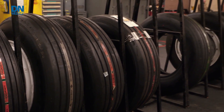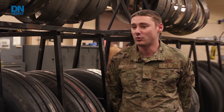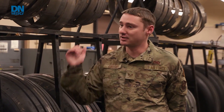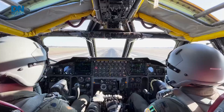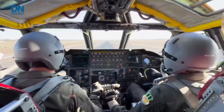Why is it important for the wheels to be in tip-top shape? It's important because if a wheel has damage on it, it can break on the flight line itself. If the jet comes down too hard, the wheel could crack more and cause severe damage. So it's really up to us to make sure these wheels have no damage, no defects, and are ready to go.